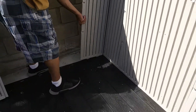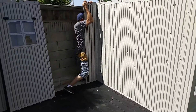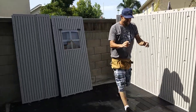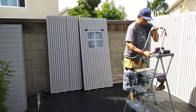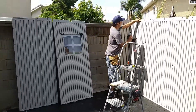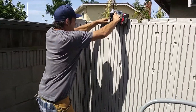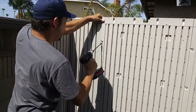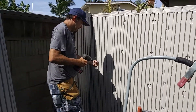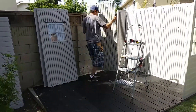Then you can attach it to the previous panel right there. Make sure you have a nice straight line across — just like a clothesline is what I call that — right where my thumb was there. Nice straight line. That'll ensure when you go to do the roof and the gables, everything's just lined up right on the money.